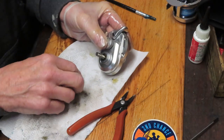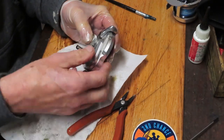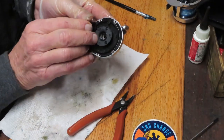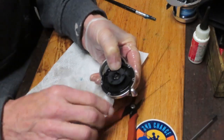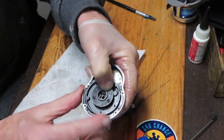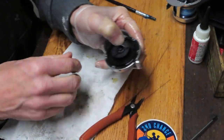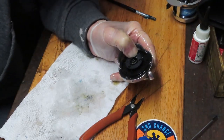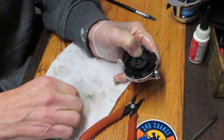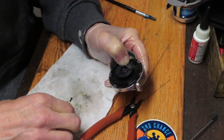It sounds like it's set properly, and this is your bearing that we were talking about with that shield. And before I tighten this up, I want to make sure that I have this in the hole, so I'm going to slide this. As long as my pinion gear is retracting, we've got it correct. All right, we've got that set. We're going to grab our 4 screws that are going to hold that assembly.